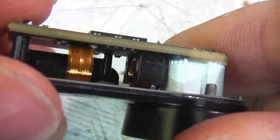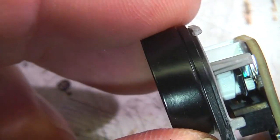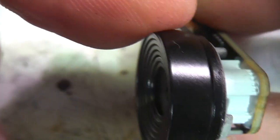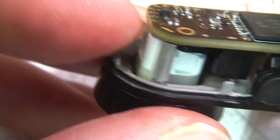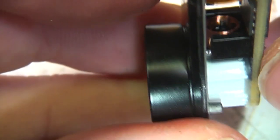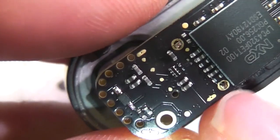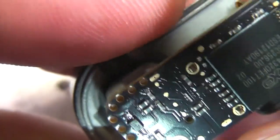Over here is the sensor. We've seen a picture of this, as Seek Thermal published a video of this chip being die bonded to the board. So this is the actual sensor chip here, with the lens assembly, which looks like it's glued onto the PCB. Hopefully that lens is attached to the board and can come out as a whole unit, which would be nice. And there's this shutter unit here. You can see the coil on it behind there, and it looks like it's press fit into the board. They've sized these holes so this thing just presses in, so it doesn't need soldering.